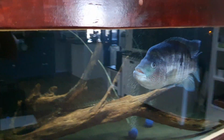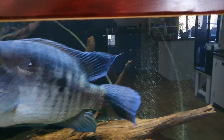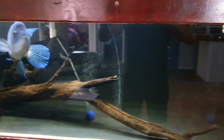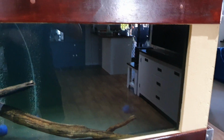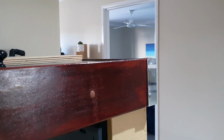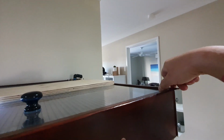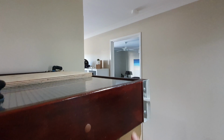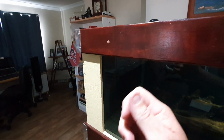Now I'm going to catch up from where we left off from video number 2. We had to lay the fabric down in the corners and paint them in with the damp stop. All I did was put a clamp on the corner of the tank and let the fabric lay down on the inside. I did that for all 4 corners. The fabric lays down inside. Then you get your damp stop. You don't even have to be careful with it.